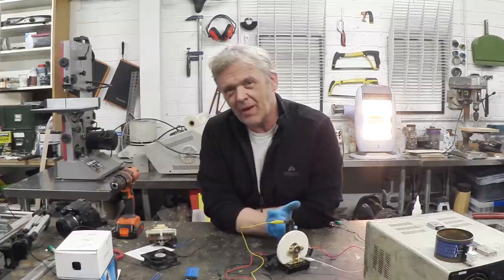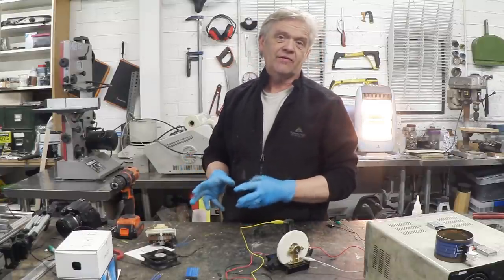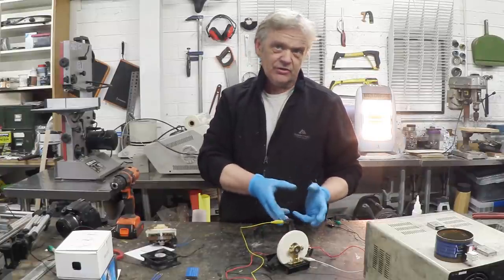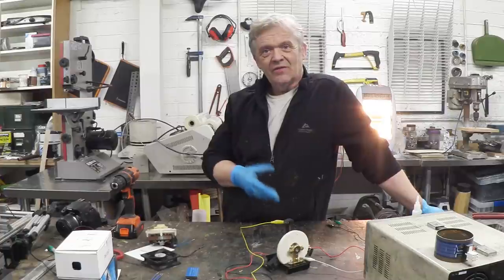It's mechanical, so it will wear out. But if you think about the average lifespan of a car — ten years — and this lasted two years, which is the average lifespan of an electric motor brush, you'd need five of them. So you'd be spending about fifty pounds as opposed to five hundred pounds. This could easily be made of clip-in modules, so it could just be part of your service routine. Silicon can't handle high power very well so it's expensive; mechanical can be a good solution because it's a lot cheaper and really easy to repair.